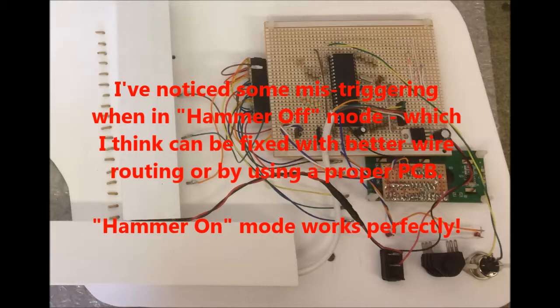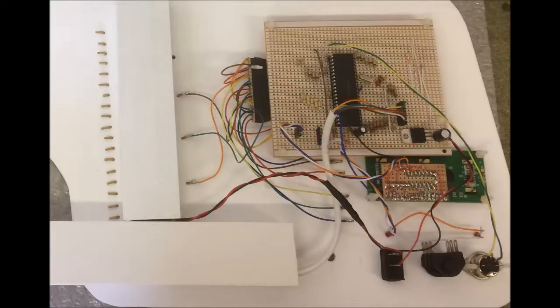As it turned out there wasn't too much of a problem, although I have made provision to alter the touch-sensor sensitivity with the control buttons. If there's enough interest in this project I'll definitely get some PCBs made up to house all the components, including the LCD interface and options for an audio amplifier and VS1053 board, and then I'll be able to make sure the touch-sensor routing is optimal. I could also make programmed PICs available, so let me know if you're interested.